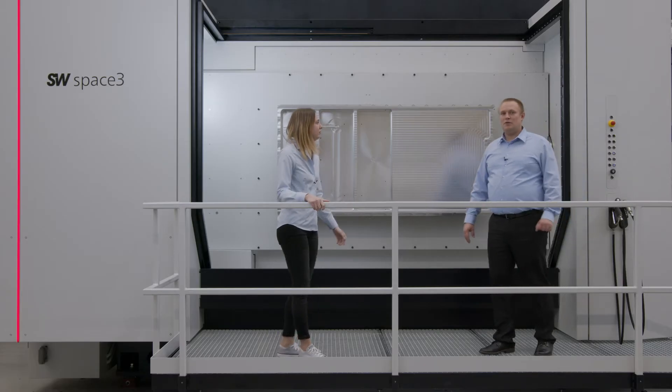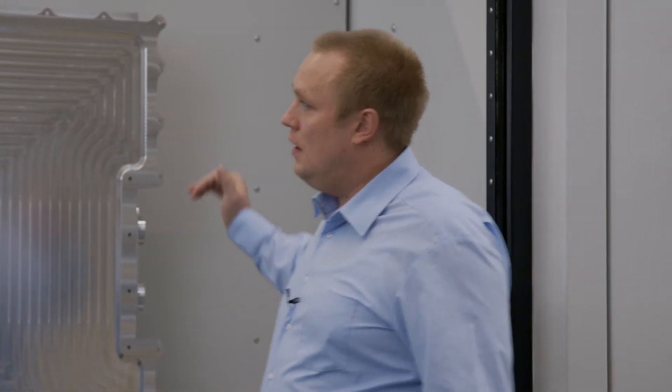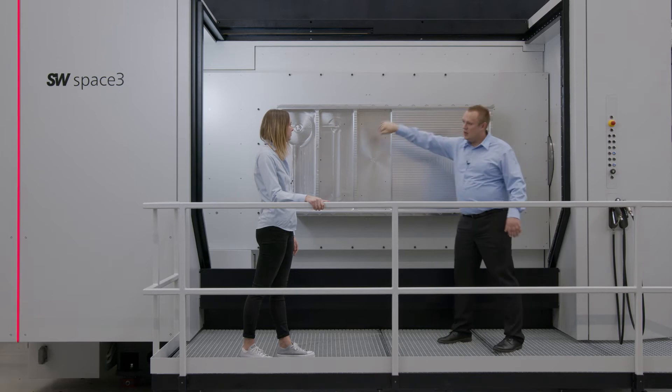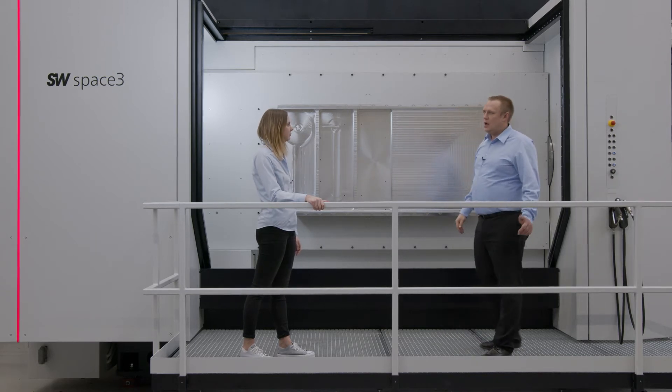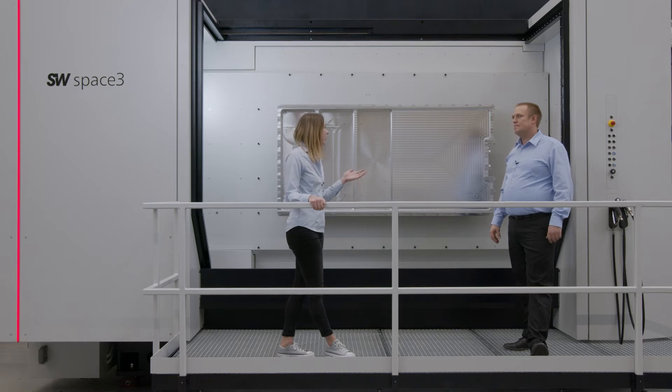The second step of the process is the semi-finished part, which represents the bottom plate and the cross beams. They are welded together and then mainly machined on the side faces to prepare these faces for the final weldment of the side wings, front and rear. The typical cycle time of these semi-finished parts is pretty long — we're talking about 28 minutes per part. That needs to be pretty precise, correct? Maybe you can talk about that a little bit as well?